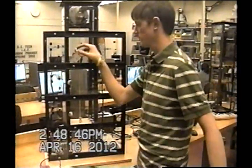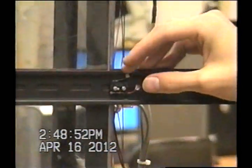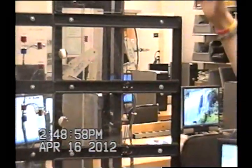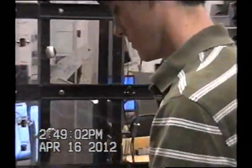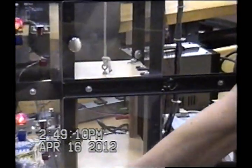The reason the doors break movement: you have the limit switches here, which activate once the door is opened, and that opens one of the bits we had programmed in to stop movement. We also have over-travel switches — in manual mode, if you try to go down too far and it trips the over-travel switch, it cannot move down. It can still go up, though.